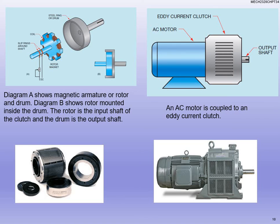Remember, when we're talking about variable voltage and magnetic clutches: we use a clutch to engage and disengage the shaft. When we're varying the voltage, we're not changing the speed of the field — we are simply weakening the field, which is what makes the motor slow down. Remember, this is all for fractional horsepower motors; you're not going to have a 250 horsepower motor with variable voltage. Email me if you have any questions, and I will see you in class.